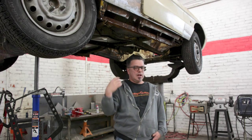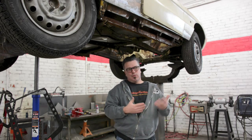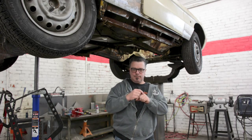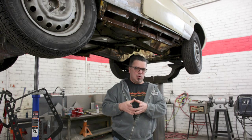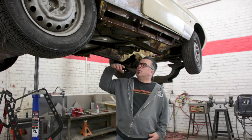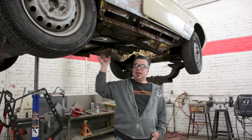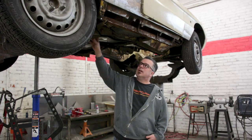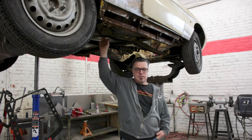So we have to get rid of a lot of the dead metal and reconstruct the way it was done, just with different welding techniques. That's why we also use the weld-through primer, because right where all the welds are, the primer will burn off, but effectively it stays contained to just where the welding process was, so the primer stays in place everywhere else, minimizing the rust. Now once it's all said and done, we are going to seam seal not only the inside but the outside. We're going to protect all the metal, because if you don't protect it, it's sure to repeat its rusting issues, regardless of how much improved the floors are from what they used to be.